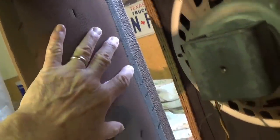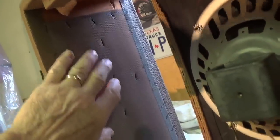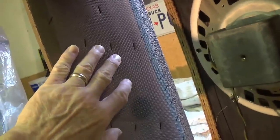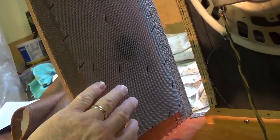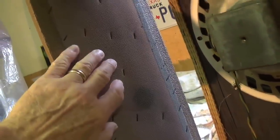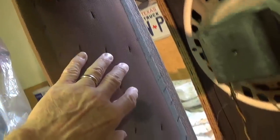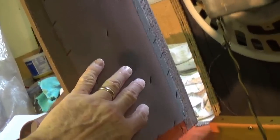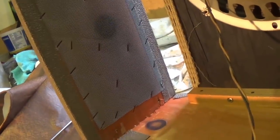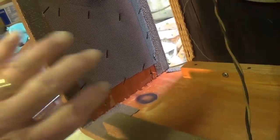When I'm doing a job like this, I always get a kick out of the window screen that is stapled with about 9,000 staples to the ceiling of the cabinet. Now, my assumption is it acts as a radio frequency shield or barrier of some sort to protect the signal path within the amp from picking up spurious interference. Those of you who lived back in the early 60s remember that in places like Mexico especially, there were AM radio stations that had like 100,000 watt output power.